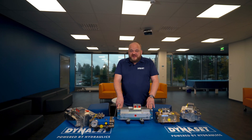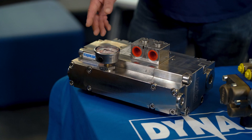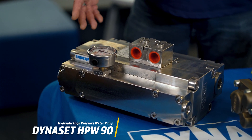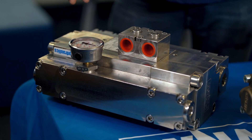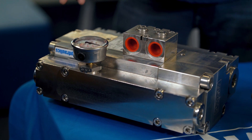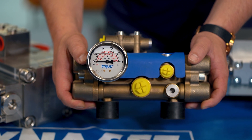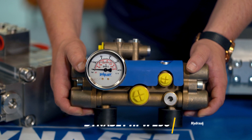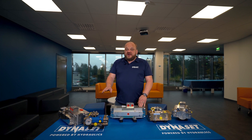One of the great benefits of hydraulically powered water pumps is the compact size. This pump here on the edge of the table has a maximum water pressure of 90 bars (1300 psi) and a maximum flow of 150 liters per minute (40 gallons per minute). This pump weighs 11 kilos (24 pounds) and the water output power is 12.5 kilowatts — approximately 1 kilowatt per 2 pounds.